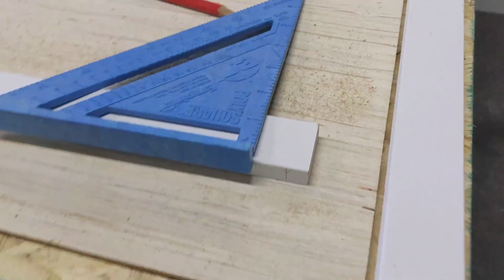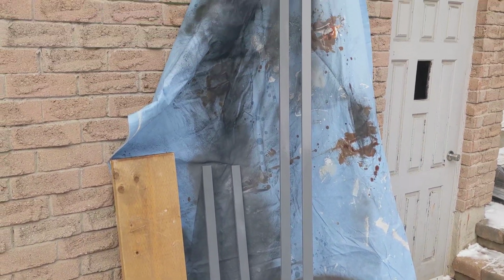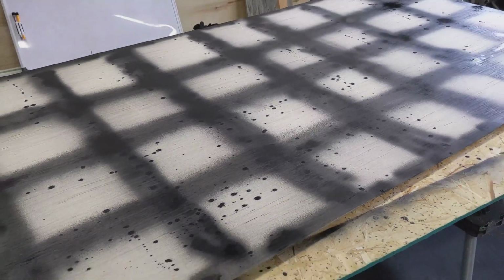After cutting the plywood to size, I cut the MDF trim to wrap around the plywood, then took those outside to paint a grey colour. Back inside, I sprayed black paint on the plywood in the approximate location of the mirror joins. Any gaps in the mirror will show as black rather than plywood.